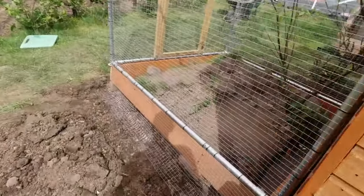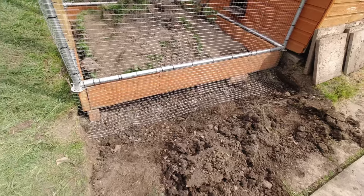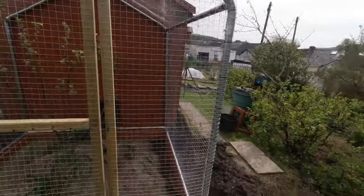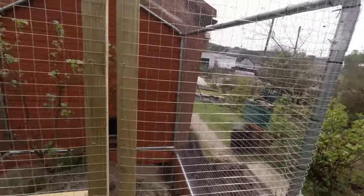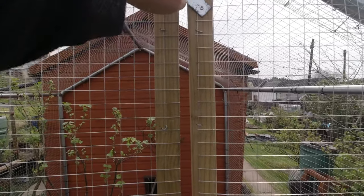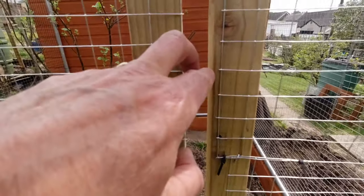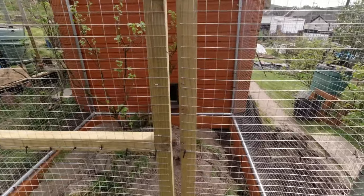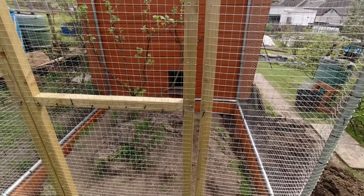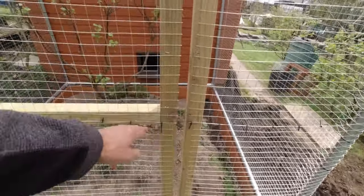We're doing pretty well - we've got the mesh pegged down now so that no rodents can burrow in, and we'll backfill that with soil. The front is now on and tied to all the bars, and the door is cut out. Unfortunately, even though the door's got a centimetre gap at the top and just over a centimetre at the bottom, the middle's about two and a half centimetres - so this piece seems to have bowed out during the wet winter weather. I'm going to put a strip of wood all the way down the door just to close that gap and enable me to fix the lock back.